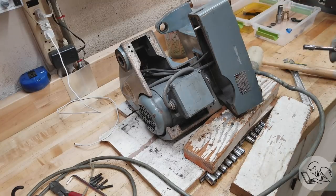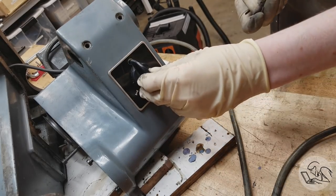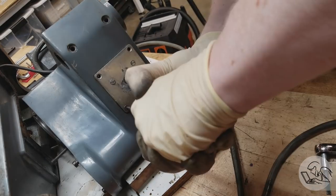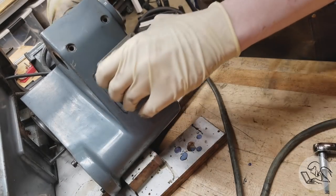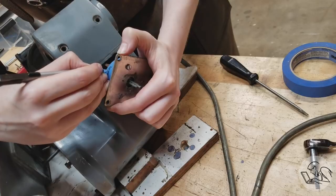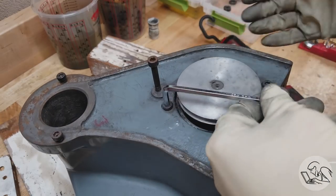The castings are separate but still held together by the motor capacitor wiring. To disconnect that I need to get access to the other end, so I take the power knob off and remove that cover plate. The screws were quite seized in there — I think there's some dissimilar metals happening, so there was a lot of corrosion. They took some coaxing and hammering to persuade out. Now I get a look at the back of that switch — there's quite a bit going on back there, so I put tape on there and start labeling things. With that motor capacitor out, I can now get the motor itself out. It's held to the upper casting with four big cap screws, also Loctited in place for obvious reasons.